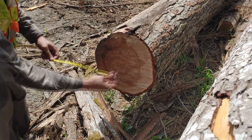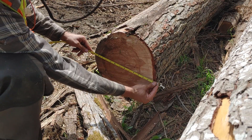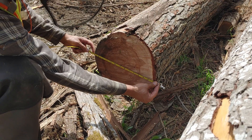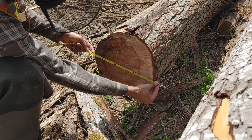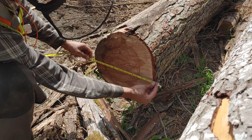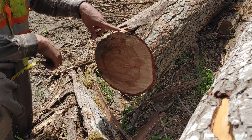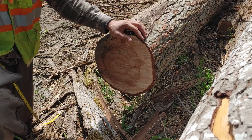Let's scale this. Here's the top of the butt log. We know the small one's 8 inches. I always burn two, so it says almost 15 but I subtract two, so 13. It's almost 13 but you always round down, so this is a 12-inch top. You can measure both ways - yeah it's 13 that way - but they always take the small end. So this is a 12-inch top, 36-foot log, and an 8-inch at 32. Let's figure out how much board feet we got here.